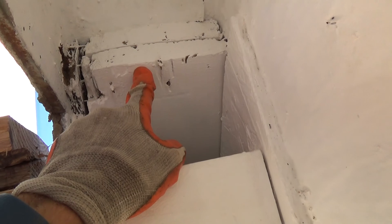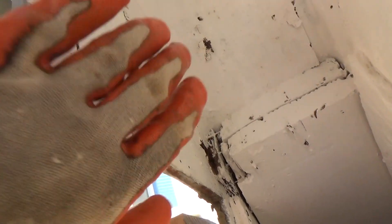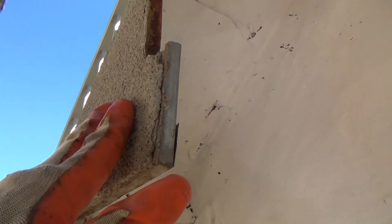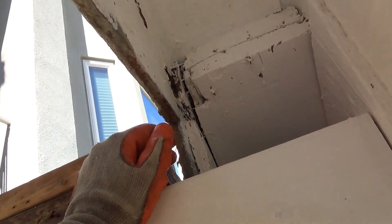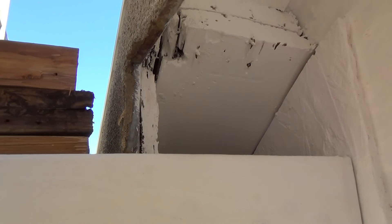Because if I put these four-by-twelve beams in, I can't really get up in there to do that. I want to match these — they're two-by-eights, seven and a quarter inches wide. I took the back plywood off up here because it was all rotted. I want to put that back in first, then sandwich the two-by-eights up in there and get it all attached properly.